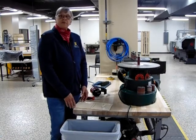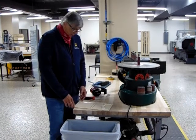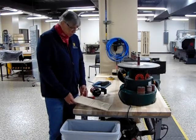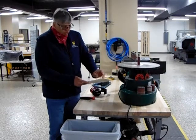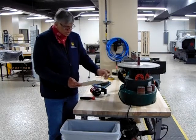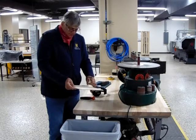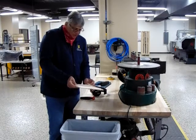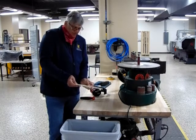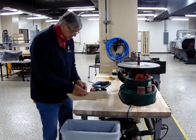Okay, now that we're done manufacturing our coaster on the Laguna IQ CNC router, we're going to bring our coaster over here. We still have the tape installed, which was used to hold our stock down in our fixture. So I'm going to very carefully remove the tape. And of course, you always want to use tabs when you do your software setup. Keeps the part from coming loose, which would either damage a tool. I'll throw that in the wastebasket.